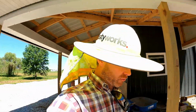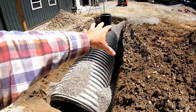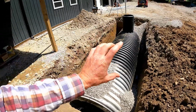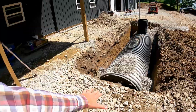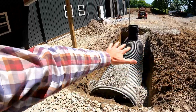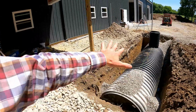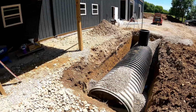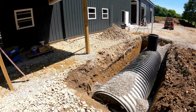That was pretty crazy there for a minute, going hard, going fast, and so we've got our tank in there now. We've got 2 feet of cover over top of it, and for heavy loading, it's one of the things you gotta do. As it gets closer to the surface, I'm going to sandwich geotextile over top of that to help distribute load, so there's never a load bearing issue, but there's going to be 2 feet of structural cover over that, so we're in great shape there.